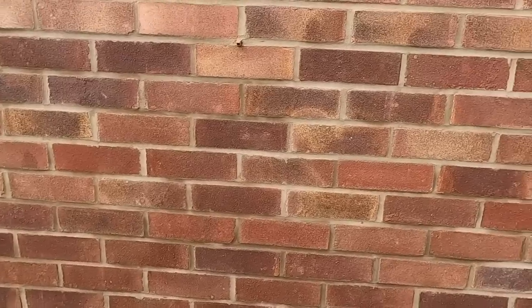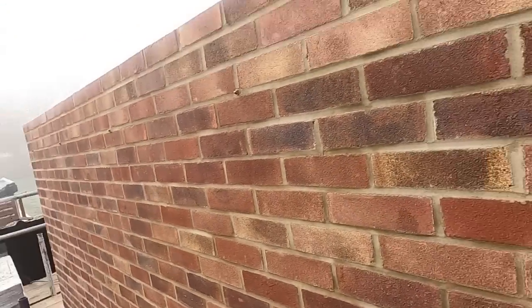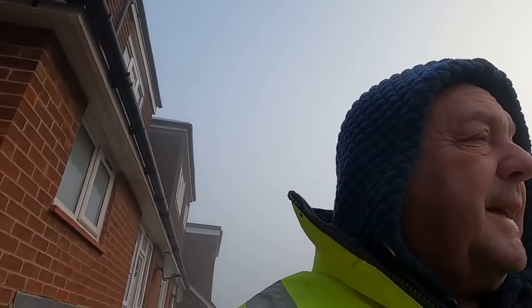Always wash down the wall first, you always do that. Wet the wall down, obviously not too much because we're trying to prevent the efflorescence, but you need to wash it down and just give it 10 minutes to soak in. That creates a barrier